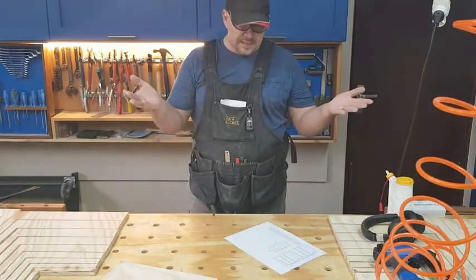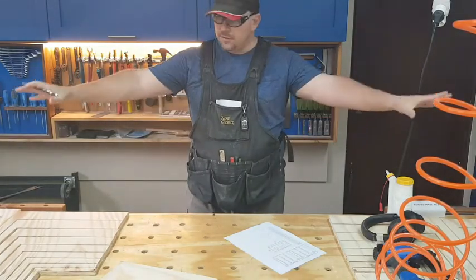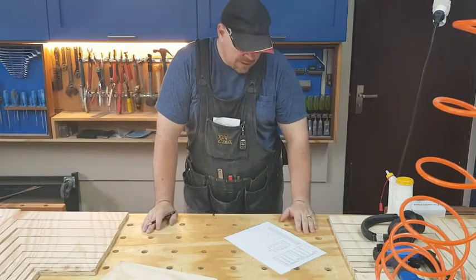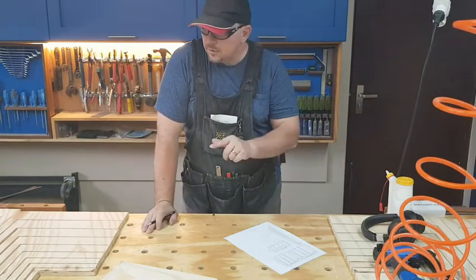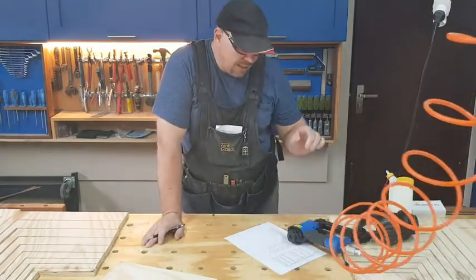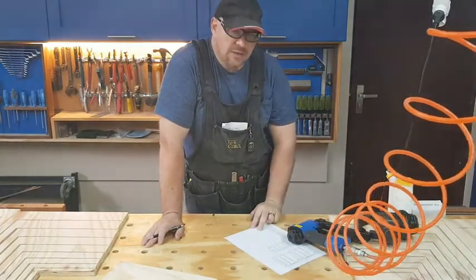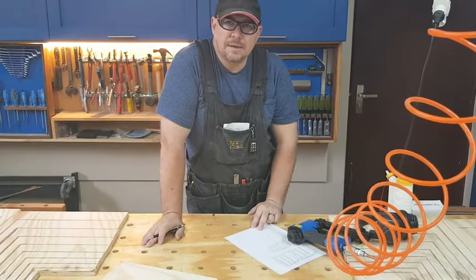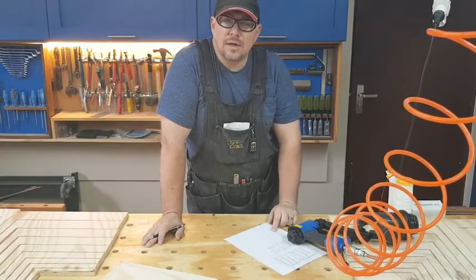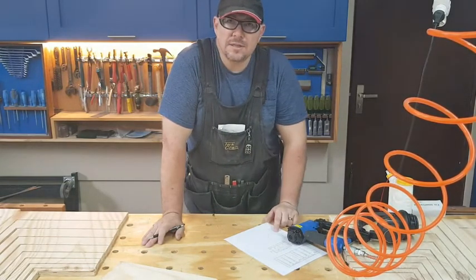So what we're going to do basically in essence now is to build half of the table, and then the other two cut panels will give us the opposite half. So I'm going to start now by putting them together with glue, and I'm going to use my brad nailer. If you do not have a brad nailer, you can still put this together in one of two ways. You can either use normal panel pins and a hammer, or you can simply pre-drill and put small thin gauge screws in as well. So I'm going to start and glue and pin these one by one.